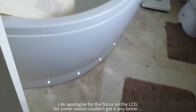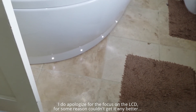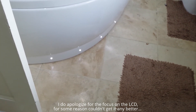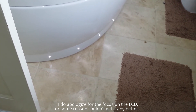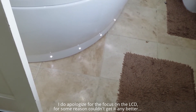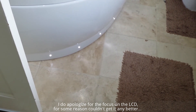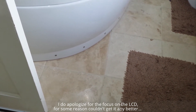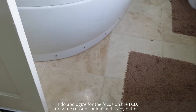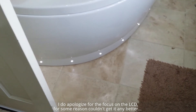The lights are on at the moment. So what I will do is I will just stay still — the movement changed to zero and you're going to see the lights going off. You can see the lights going off. I'm reading on the LCD M0, which means no movement is detected and the lights are off. Now I'm going to move — M1, it detects me in here, so the lights come on.